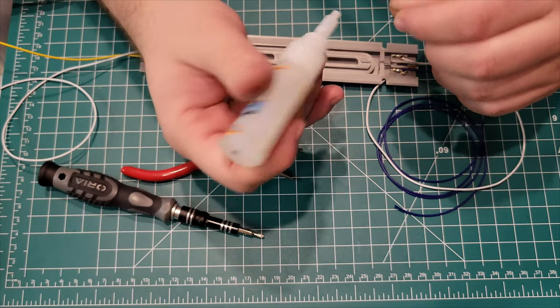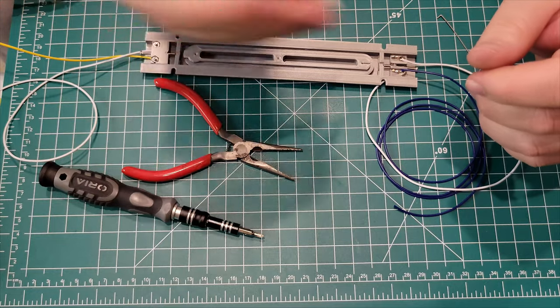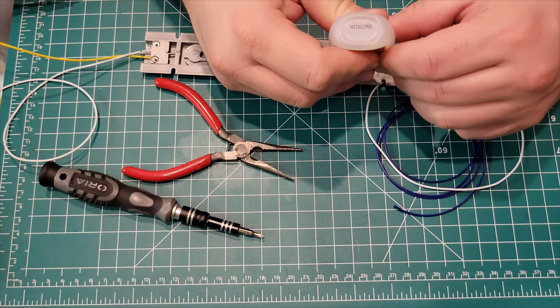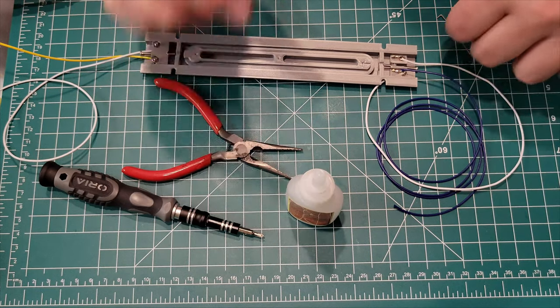The music wire that links the slider to the turnout is glued into a hole on the slider using superglue. Some of the turnouts are close to the edge, so I had to bend the music wire links for them into a dogleg to reach the edge of the assembly.